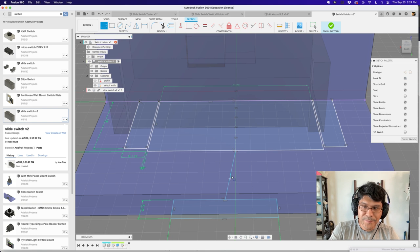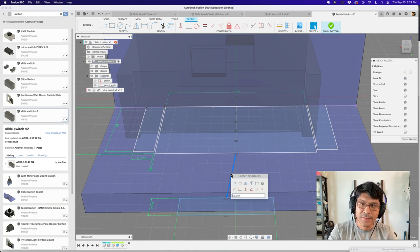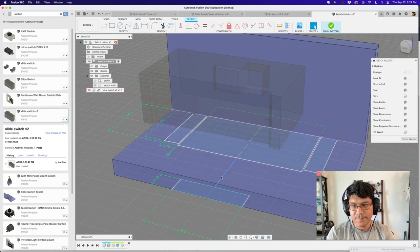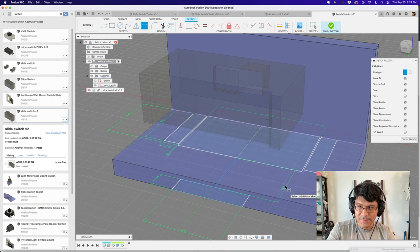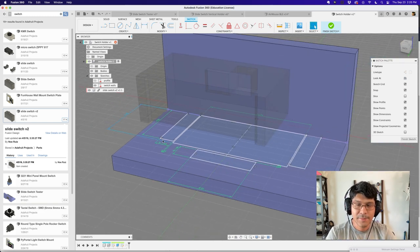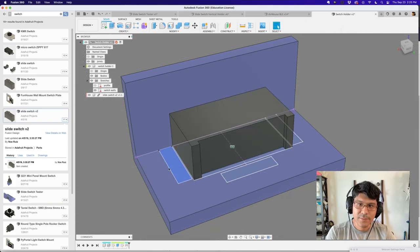And now I have this line here, and I want that line to be horizontally constrained. And thankfully there is a horizontal constraint that we can tie to it. So you can type in horizontal or vertical, depending on the orientation of the line, and Fusion will know to make it either going straight up and down or left and right. So I'll click on that, and you can see it has now made it nice horizontal, vertical. All right, so now I'll select it, hit the X key on my keyboard so that it is a construction line, and then I can use the hotkey D to apply a dimension. Now this one only needs to be 0.3 millimeters, which has a little bit more distance than our walls, but that ended up being the best value, at least in my tests. And that's all we need for our walls. So I'll hit finish sketch and start extruding.